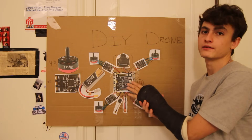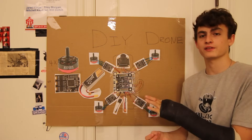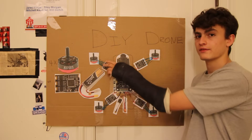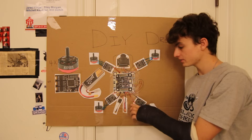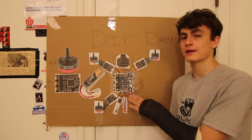All you need to know is that this is the brain. The flight controller — or FC as it's abbreviated — has a ton of different sensors on it that allow for flight control algorithms and flight stabilization algorithms. The flight controller controls every single motor by sending outputs to the speed controllers, and the speed controllers then send outputs to the motors.